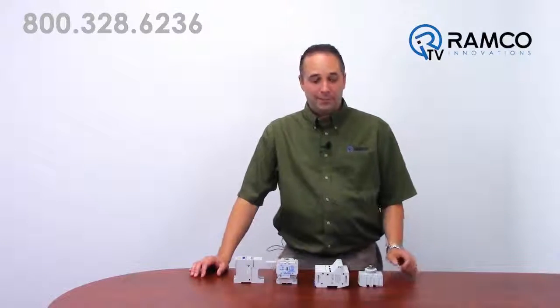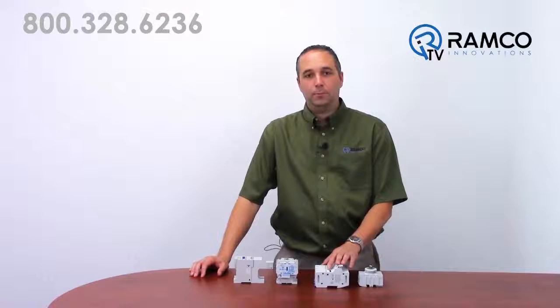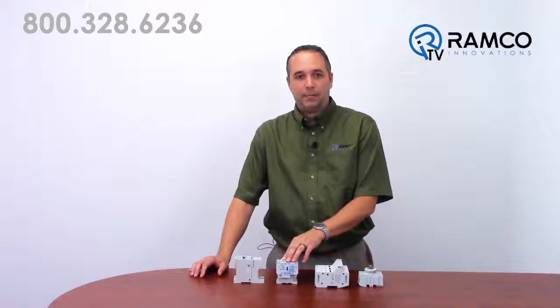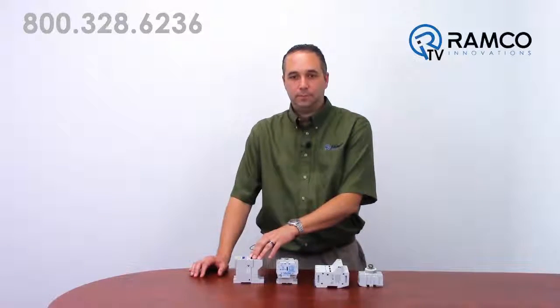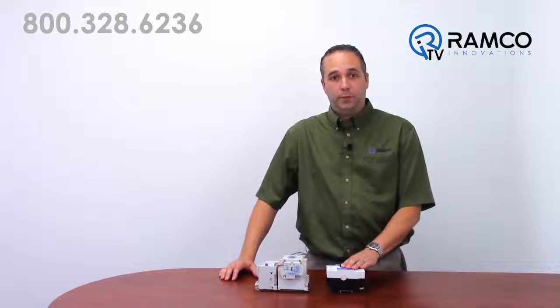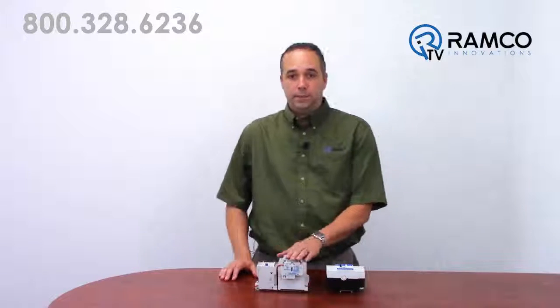As you can see in this circuit I have a disconnect switch, which when combined with a shaft and handle could be used as a lockout tagout device. This is followed by a fuse holder providing short circuit protection. Here is another circuit using a molded case circuit breaker that provides short circuit protection and when combined with a shaft and handle could also be used as a lockout tagout device. This again feeds a contactor coupled with an overload relay.